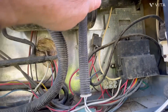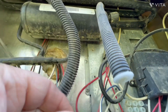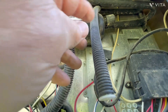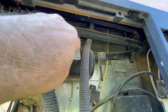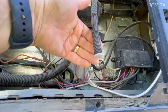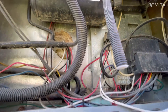We'll take a look around and I don't see any obvious problems. One point of interest: this is the drain tube that comes from inside the upper refrigerator section. If you notice on the bottom of this drain tube, there's a small plastic piece installed with holes in it — you want to make sure that yours has this installed. This is actually a check valve, and if it's missing, the refrigerator is not going to cool as well as it should. I also have this hose positioned so that it's on the other side of the condenser — if I do get any water coming out of the fridge, it's going to come right out through the vent without any problems. Originally they had it tucked back behind there, which would have dropped the water right down inside, so I repositioned that hose.